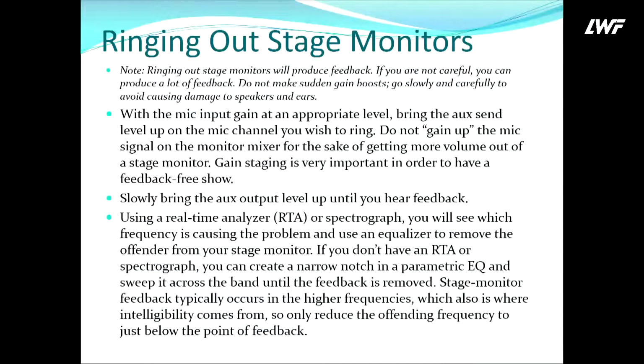If you take care of your mid-frequency, somewhere around 500 and lower frequency, that's what you pull and play with, and the howling and the feedback go away. And then you can push it. Nevertheless, that's one thing I've noticed using equalization.